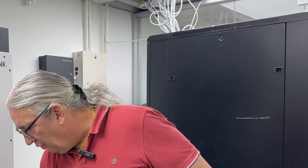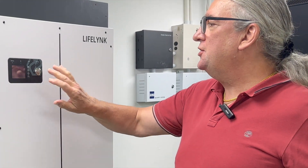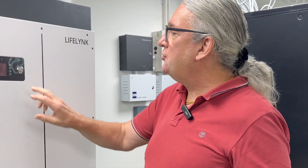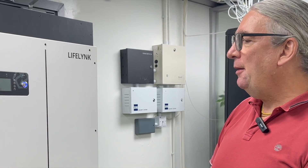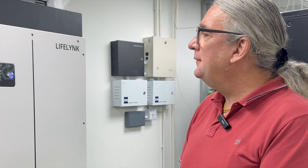We're wired and ready to rock and roll. I always suggest going onto battery initially — always run the battery before turning on the AC to make sure the unit is working. The unit has an internal battery and we can also use an external battery. Click the breaker — I've got two batteries in parallel — so I can boot it up running on battery. Press the on button and let it boot itself up.